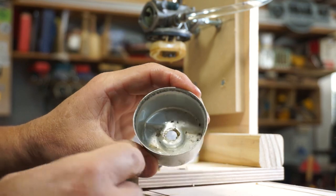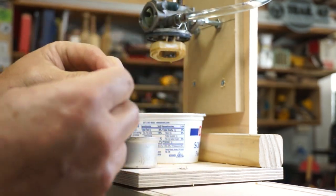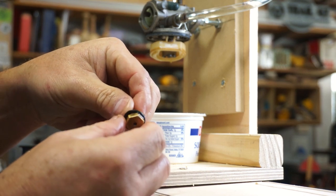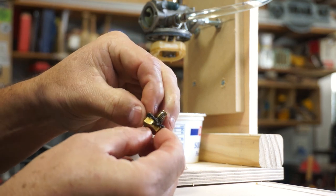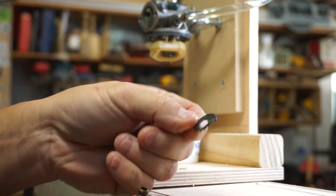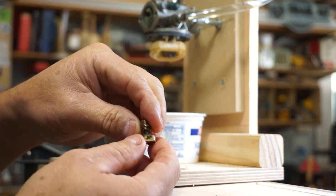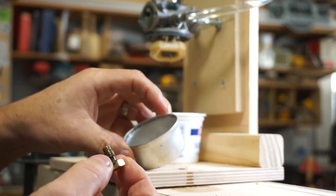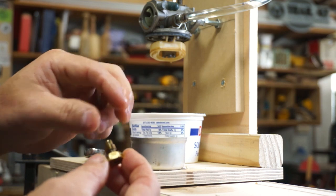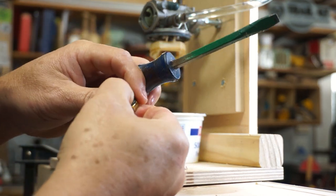There's a little bit of water but that could just be the fuel. You can see the residue at the bottom. This is the product we used — gasket dressing and sealant — it says fuel resistant, but I don't even see any of it left. I put some on top of the gasket and below the gasket and it's completely gone. Even my gasket is all torn up — why is a brand new gasket torn up? So there's no sealant left. This product says fuel resistant but it got eaten away and completely disappeared.